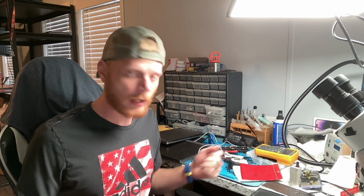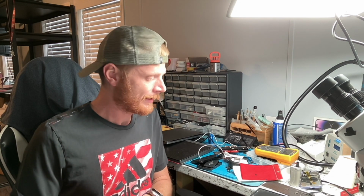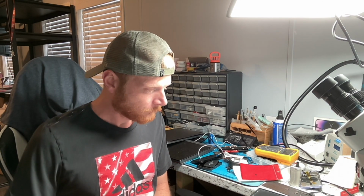It has been probably over a year since I made my last video, so I figured I'd make one on a MacBook repair. Today we have an 820-0850 that came in. When it came in, I initially plugged it in. I got 5 volts and 500 milliamps, which tells me right away something's not right. Normally what you get is like 60, 256, somewhere around there. And then it kind of goes up to the 20 volt mark and builds up from there. Normally you do not get 5 volt, 500 milliamp right away.